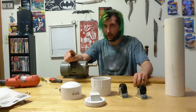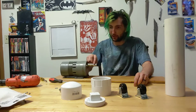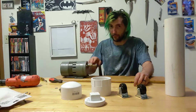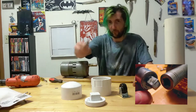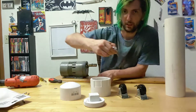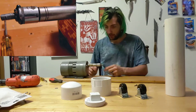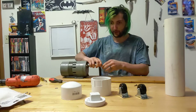The actual bar on this had a notch on it, so I basically took a ratchet head and stuck it on there — it's for removing spark plugs and stuff. It fit on there nice and tight. What I did was I went and welded a bolt to the socket, so now it fits real nice and neat in there. That way it's removable if I need to take it off — kind of a neat little trick I figured out.